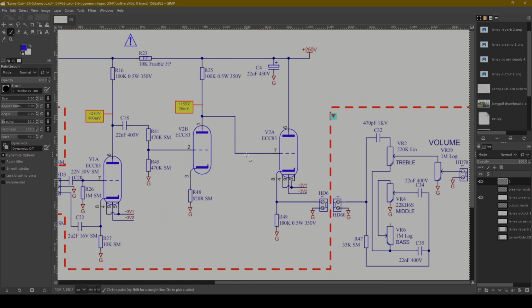Okay, now we get to the tail end here of this preamp circuit, and the biggest thing to note here is we've got a very Marshall or Bassman style cathode follower. So our signal gets amplified here. We run into the grid of this last triode, number 4. Now this one doesn't have a plate resistor to set the load line because the signal is actually coming out of the cathode, which instead of amplifying it as a voltage amplifier, gives it more of a current boost. So while the signal is not being amplified, it's basically running out of this cathode follower, which will boost its current and its ability to run through this tone stack. That's fundamentally what's happening here.